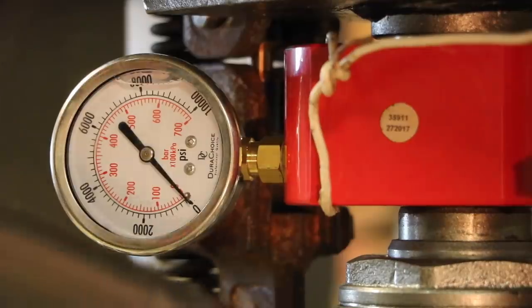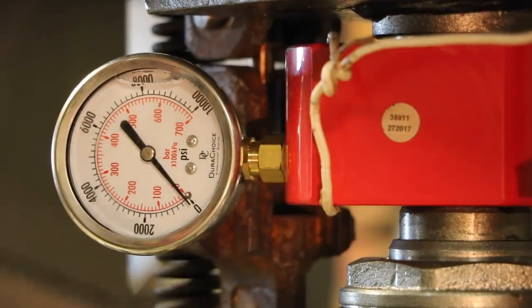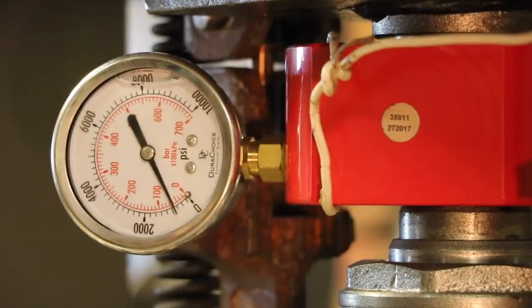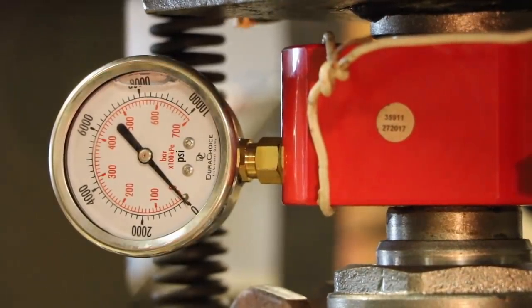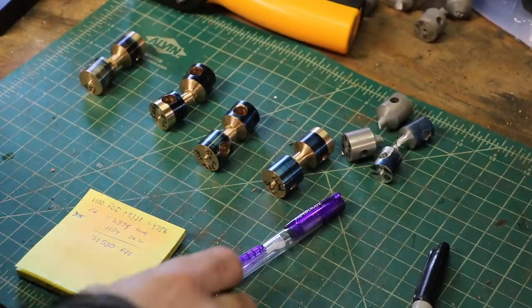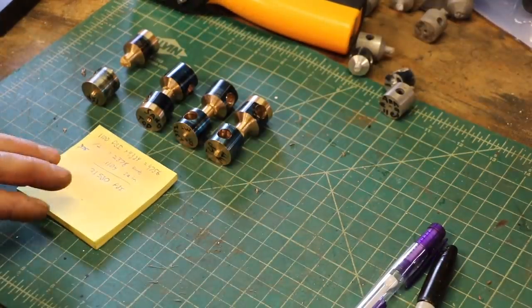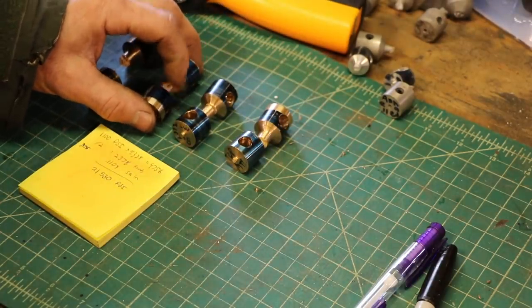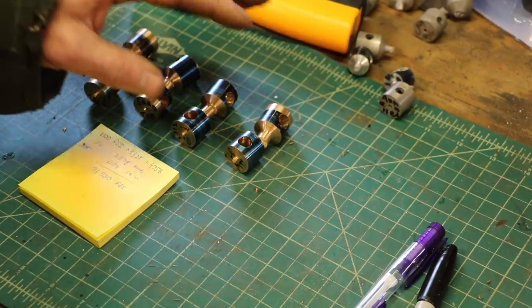Alright, we'll try the last one. 400... 600... 800... we have 900... 1,000... that was almost at 1,100. I calculated the PSI of the best sample — the top sample from the metal mold — it was 21,500 PSI. The question is, why did I get 21,500 PSI on one of these and maybe only 10,000 on the other two? I don't know the answer to that, and it makes me think again it's the sample, because there shouldn't be that much variability — unless there's something wrong with my testing procedure. The grain structure there is actually a little bit finer.